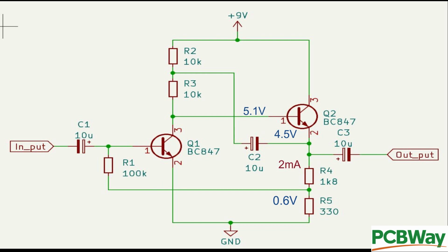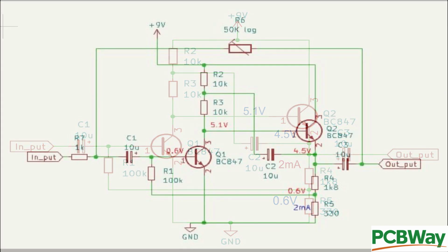Well, now you might ask, how do we turn this into a user-friendly microphone amplifier? As at the moment the circuit has very high gain which is influenced by the temperature of Q1. Well, the quick and dirty answer is more feedback, but this time we're going to use negative feedback as this will lower the gain and increase the stability of the amplifier. So let's just add 2 more components and restrict the gain to a maximum of say 50. So cue the next circuit.